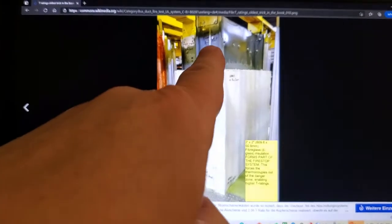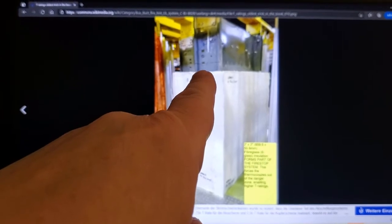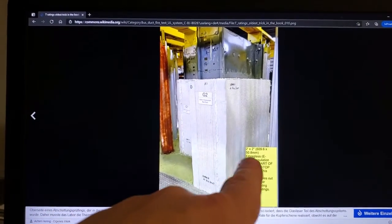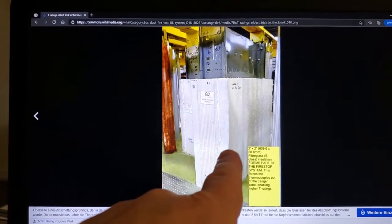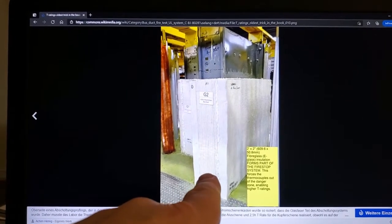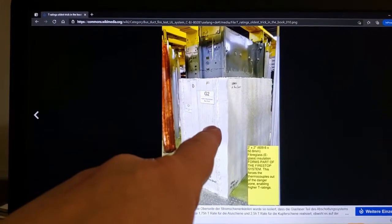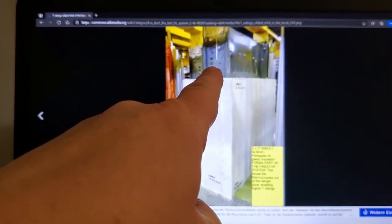Because when the bus ducts themselves are tested for electrical safety purposes, which excludes fire resistance, there was no fire stop on the inside of the bus duct. That would change, in particular, the ampacity derating of the bus duct system itself. So if I fire stop the inside of the bus duct, then the bus duct itself would be outside of its own certification listing. But by placing this on the outside, I'm also violating the bus duct listing itself.